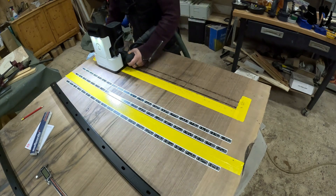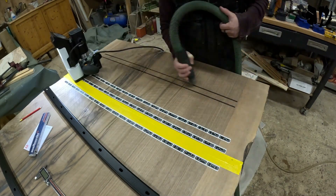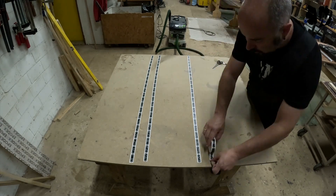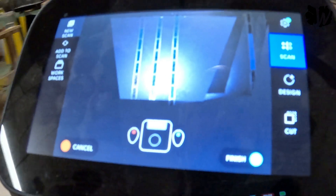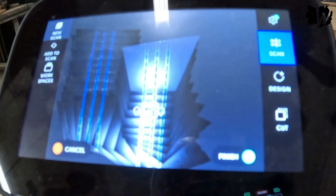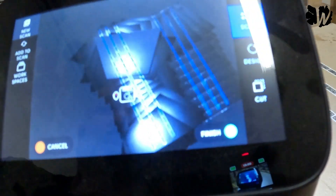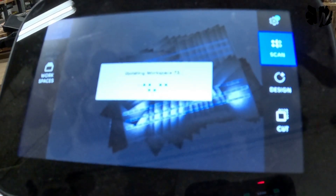Let's assume we want to cut a long rectangle to place a C inlay bar below a table. I put domino tape on both sides where I want to cut this rectangle, then I scan the dominoes — first in normal direction, but then I turn it to scan also the ends where I started the scan. So I am turning the Shaper Origin by 180 degrees while scanning.